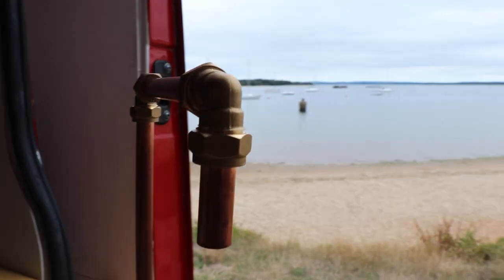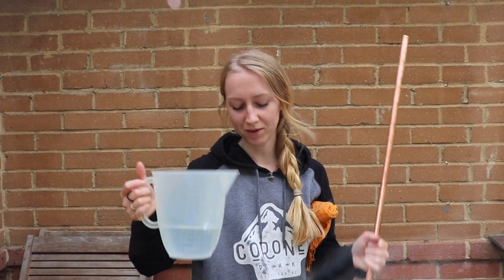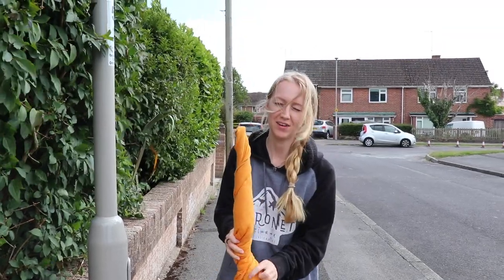This is our extremely cheap to make yet good-looking and efficient tap, and we made it out of copper pipe. Before we bought these couplings we tried to bend the pipe — we had the idea of filling the pipe with water, securing off either end, and trying to bend it around a lamppost. Obviously this didn't really work. Many people use sand but we tried it with water because not everyone has sand. We put duct tape over the top and bottom so hopefully no water would escape. The reason you do this is so it doesn't kink — if there's a solid substance inside, like a pipe bender, it prevents kinking — but since we didn't have one, we used water. Hopefully the water doesn't come out and it'll bend and not kink.